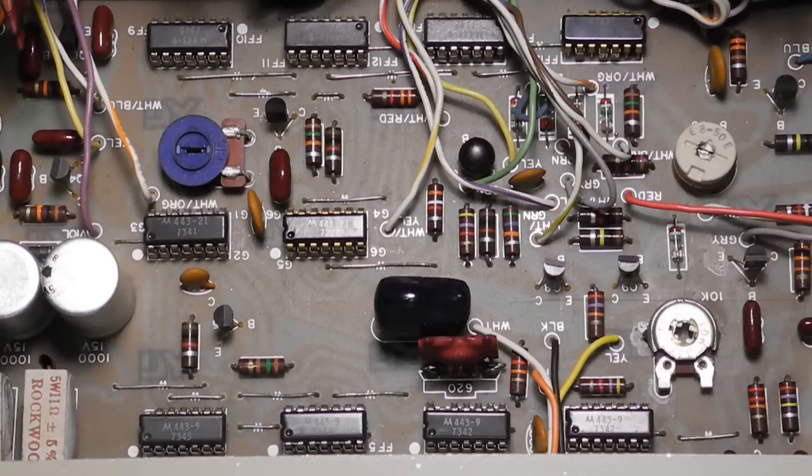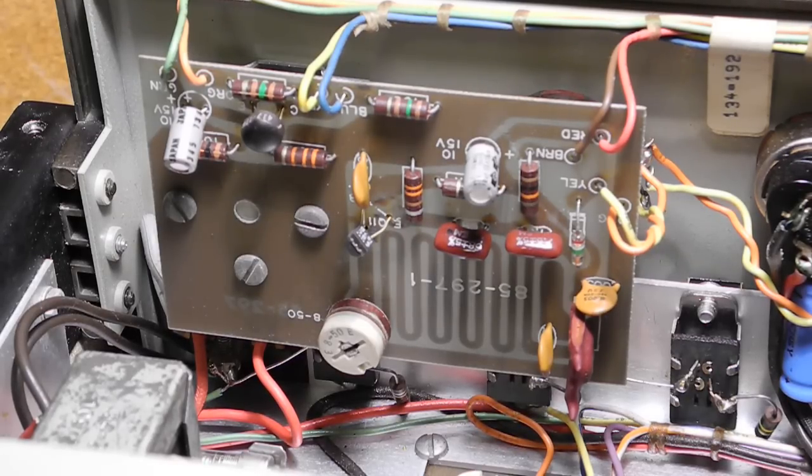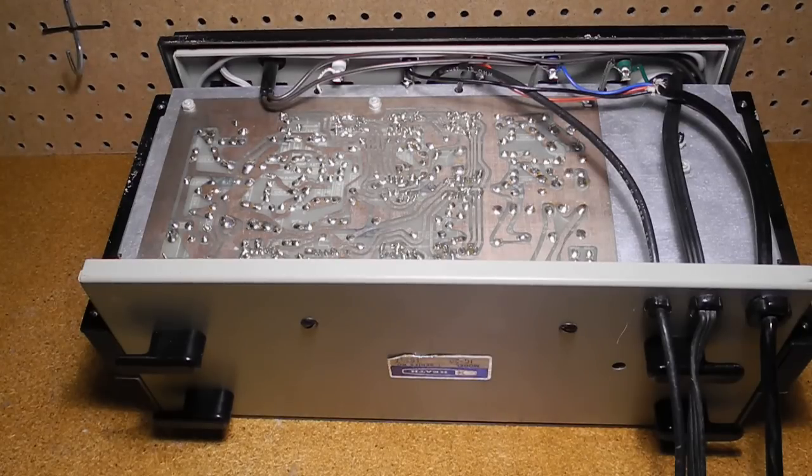The video signal is built up using digital logic chips from a 190.08 kHz master clock. It uses 10 integrated circuits, which are 700 series, a logic family known as RTL which ran on 3.6 volts DC, and was later mostly superseded by 7400 series TTL logic. It's interesting to see how the different video signals for the test patterns, including color, were created using flip-flops and logic gates. The chips have Heathkit part numbers printed on them, indicating that Heathkit was able to buy chips in high enough volume — in this case from Motorola — to have them custom branded. Mounted vertically is the video circuit board, which generates the RF signal tunable from channels 2 through 6 using a variable capacitor. There's one inductor made from tracks on the circuit board. Underneath the chassis are the connections to the power cord and test leads.